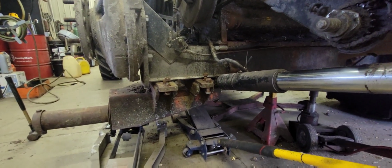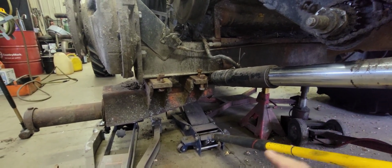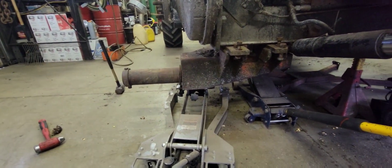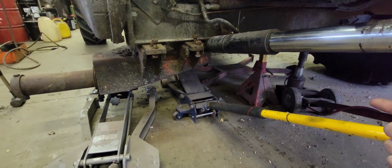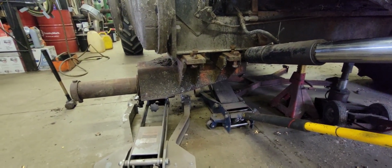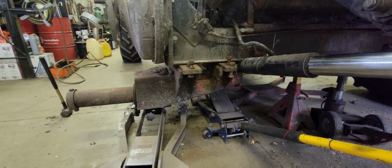So what I'm going to do is go ahead, pull that tire off, take the two track frames, bolt them to the cross piece, and then hold them up underneath the combine. I'm going to put floor jacks under the end pegs here, one on each side, and the transmission jack in the middle on that big flat spot. And by then, Dad will be done spreading cover crop rye, and he'll be back, and we'll be able to jack it all up at the same time and get it up tight against the axle, and then we'll go from there. So I'm going to get all this stuff done real quick.